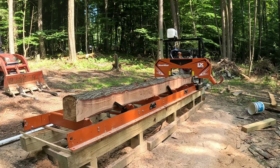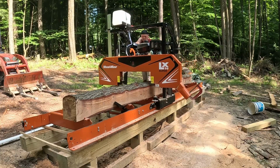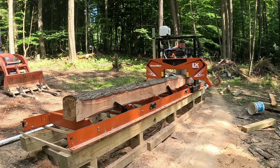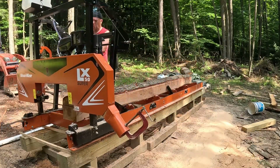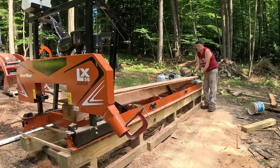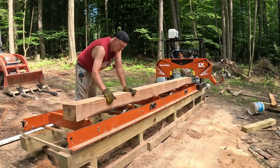I'm continuing to cut here, as you see. It's going along good. At least I'm not hitting the stops or anything else right now. I didn't have any big issues during the cut. I try to get as much wood as I can. As you see me cut this one piece off, then I'm going to cut a 1x out of it. It's a 1x6. I've already got the sides at the 6-inch cant, so that's really what I'm going to be making, a 6x6-inch cant on this. And this will be one of my rails. And as I said, you will see this in my next video, my next project.